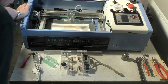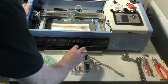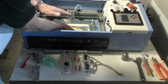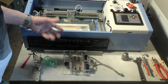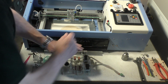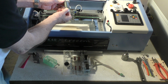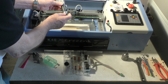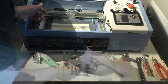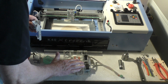that you can find on lacyuser.com. One of the issues that arose when I came to use this kit was that we didn't have enough depth in here to put items on here and engrave over the top of them. The standard lens tube assembly that I had on here, we've got this adjustment up and down on the lens tube. Much simpler, easier and quicker than a Z table. The problem is this is too deep when we put this in the machine.